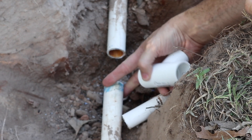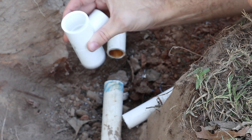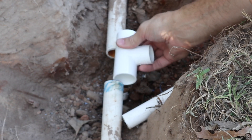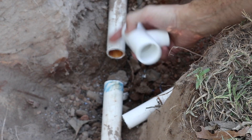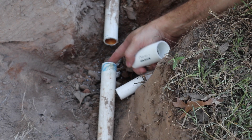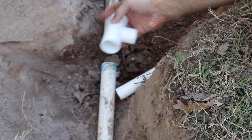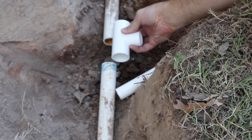So if you've made a mistake, or there was a big break in your line and you don't have enough pipe to stick into the end of your fitting — like this one, this is not going to be the proper distance — then you're going to need to use a repair coupling. I'll have to cut this line back a little bit further, put the repair coupling on, and then add some new line that's the proper length to get this fitting positioned properly.